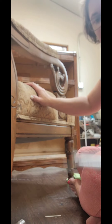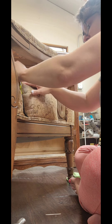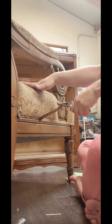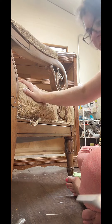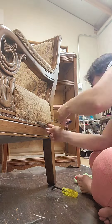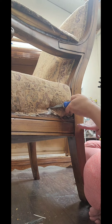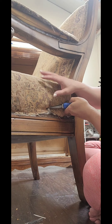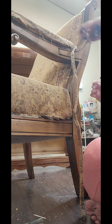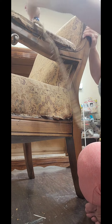There's probably about 10,000 of these. Typically a double welt cord is glued on as well as stapled on. This one looks like it's mostly glue. I want to slow down again so you can see what I'm doing. I'll put my new fabric there and then I'll put nail head trim, and it will cover up any place that I have fabric stapled down. I'm careful about just grabbing any of the material that comes off of here because you never know where a staple is still holding on.